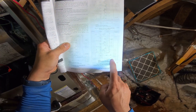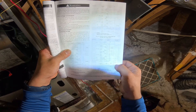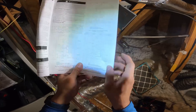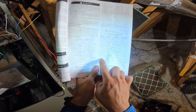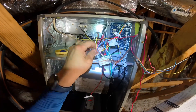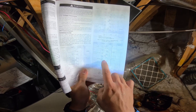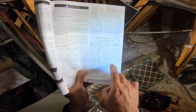Okay, heat pump — so orange to orange. Y out, which is your dissipation board, goes to the heat pump. Y out — it'll tell you here too — Y to outdoor unit, so Y out to heat pump. Then yellow from the thermostat goes to the dissipation board, which is Y in — so Y to the thermostat. Then all your commons are together: your thermostat common, dissipation board, fan coil common, outdoor common — basically your commons are all together.